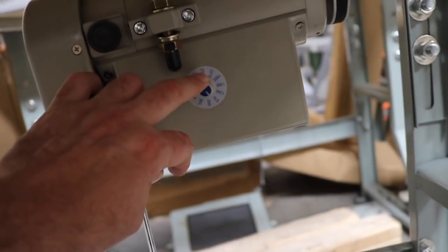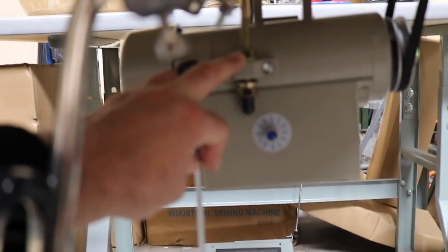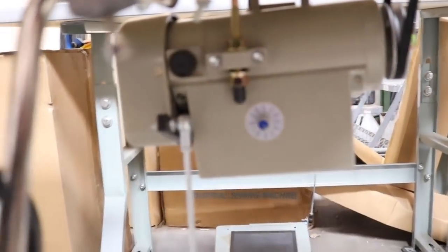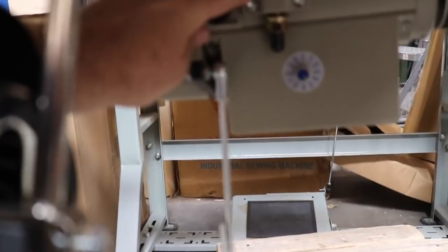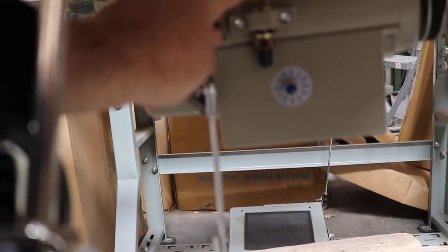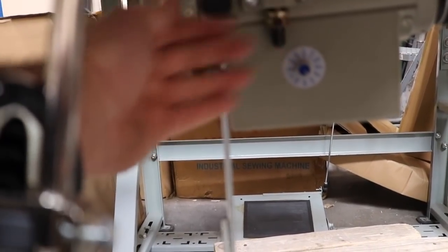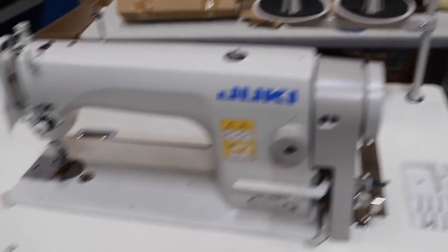It's got to be springy. This dial is to adjust the speed. And if the belt is too tight, you don't need a new belt — all you have to do is raise this nut and then adjust it so the belt tension will be corrected.